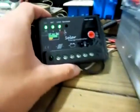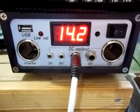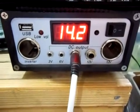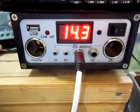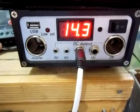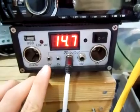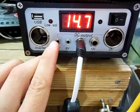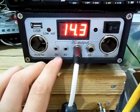Right now you can see the PWM charge controller — see how the voltage is fluctuating a lot like that? That's because it's actually pulsing my batteries. It's normal for your voltage to rapidly increase and decrease like this because it's pulsing it. The voltmeter here just can't pick up the voltage fluctuations as quick, that's why it appears to be jumping a lot.